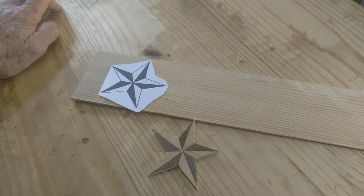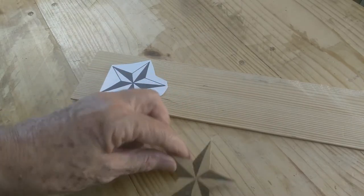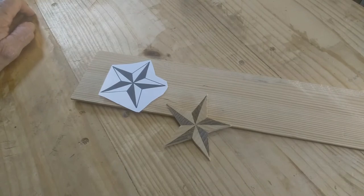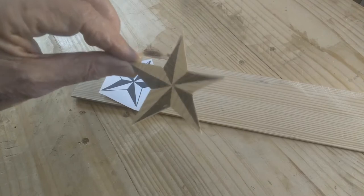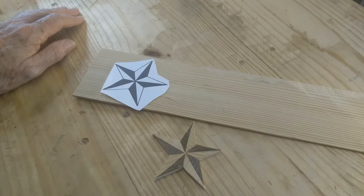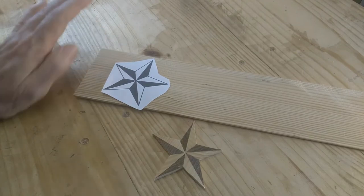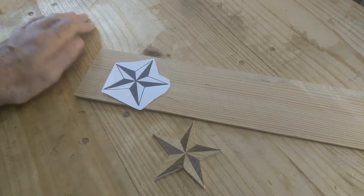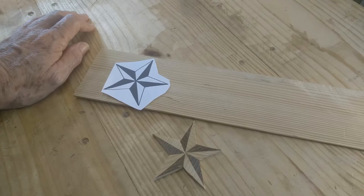With intarsia you can do all kinds of things — you can even take individual pieces and round them to make it look 3D. I've never done any intarsia; this is as close as I've come, but I call this segmentation. I'm taking different pieces and putting them together — in this case, stacking plain wood and stained wood and switching the two halves to make an image. That's just one version of segmentation. So I'm going to set this up, cut it to fit, stain one piece, and once the stain is dry I'll stack them and mount the pattern and we'll be at the scroll saw.